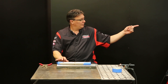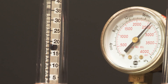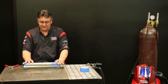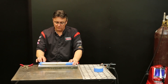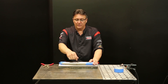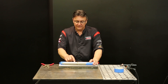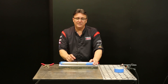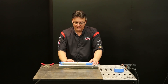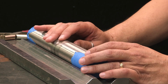I've got my dual flow regulator set up here, with my purge side running at about 15 to 20 cubic feet an hour into the tubing. Because you want to make sure this pipe stays purged even while welding, so you want the argon flowing inside while you're welding, and of course argon gas on the outside when welding — so you've got dual purge. Inside, you're getting out the oxygen and nitrogen to stop the sugaring or stop the chromium oxides from happening. We're going to weld half of this with purge and the other half without purge.